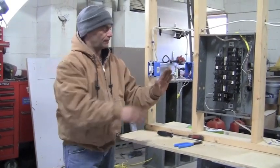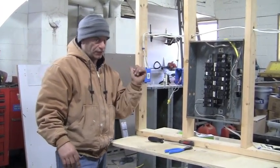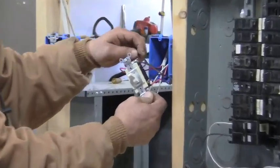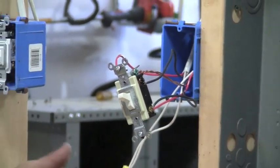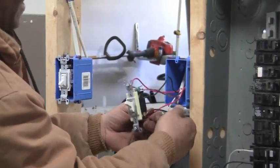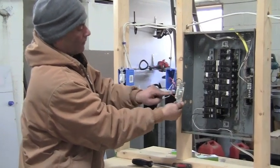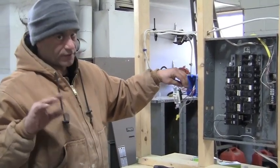All right, I cut the wires and we connected it to our switch. Keep in mind how I wire this one. We have our wire that's going from one three-way to the other three-way, cut it in the box. If you can zoom in here, take a look at this. I have my black and red wire from one switch connected to the top — because it's a four-way, there is no designated top and bottom. I have the red on this side and the black on this side, both on top. Now with the other wire coming from the other switch, I have the black and the red wire connected to the bottom — the black wire on the same side as the other black wire, and the red wire on the same side. And of course we have it grounded. Very, very important that you ground all your switches and outlets.